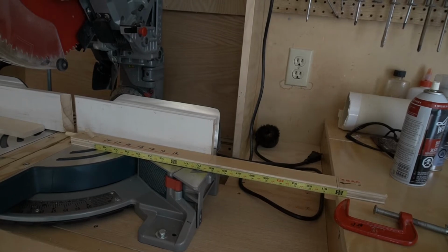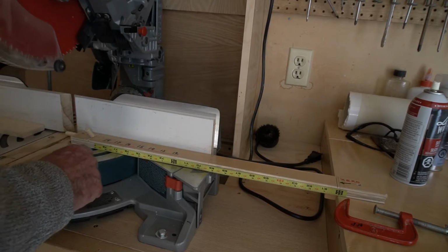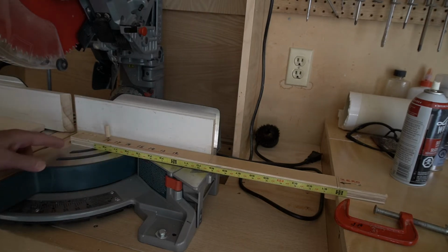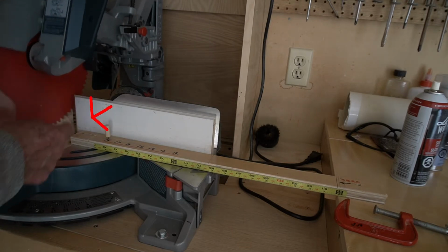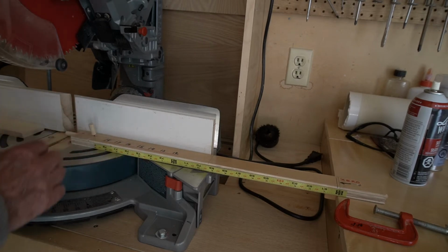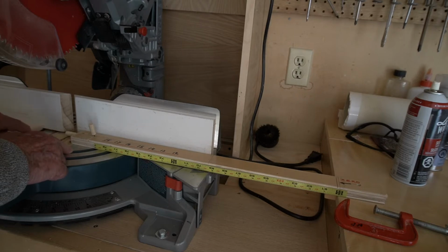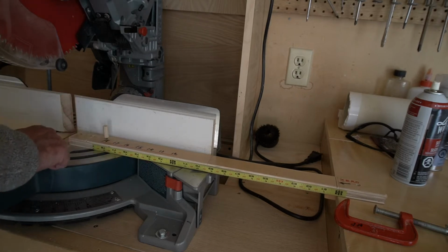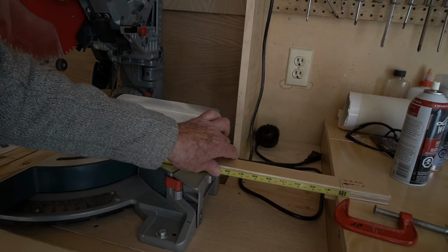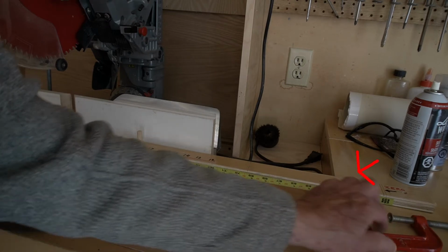We'll set the system up for a 3-inch offcut. That is the zero mark. This slides up, back. When you cut the offcut, there's no chance of the blade picking it up because this is clear. Rather than the stop against here and the material against there, it will pick up when the offcut's here. And you pull this back, and now the space is there, and it won't pick the offcut up. We'll set this precisely to a 3-inch cut, right there.